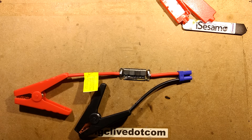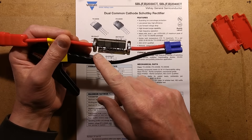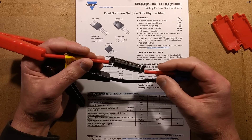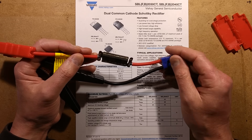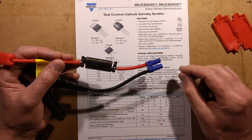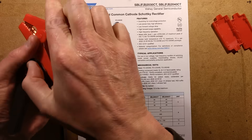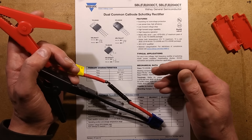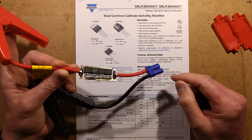I've found the datasheet, and a slight correction: I kept saying 'insulation' when I meant 'resistance' of the leads. What I was trying to say is that packs quoting 2000 amp output - considering it's all low voltage around 12 volts, with the battery's internal resistance, switching circuitry, this connector, lead resistance, voltage drop across the diodes, and contact resistance - it all adds up. Even if 12 volts stayed steady and you drew 2000 amps, the combined resistance of everything would have to be in the region of 5 milliohms - that's going to be quite tricky.